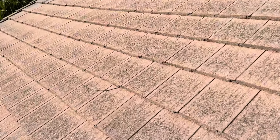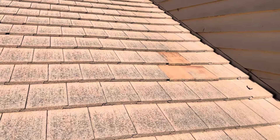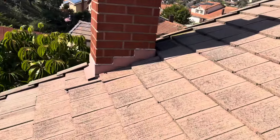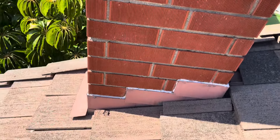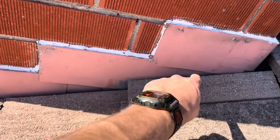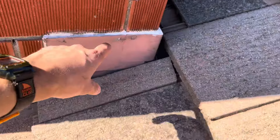Something I wanted to point out here — we see three replacement tiles that have been put there in the past. Moving on, we always like to check the chimneys because these are vulnerable areas for rain and weather. It seems to be flashed properly. We see the step flashings and the counter flashings with mastic applied on top.